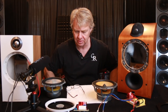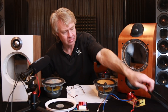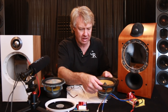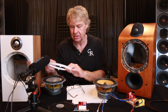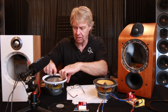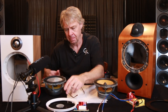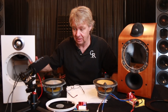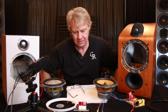The Kevlar definitely has a stiffer feel to it. Taking these apart was pretty easy. This one mounts with just two screws and then it has a massive steel plate that goes down over it, locks down on it, and screws everything down. This one has a lot of screws holding it down and then it's just got a beauty ring that snaps on to the speaker. To remove it you just gently go around the inside edge, pop the four push-in connectors off, and it comes straight off and then you can unscrew it. At least you can take the woofer out — you could not take the tweeter out unless you get real creative with fancy tools and a mirror on the backside, and yeah, that'd be a mess.